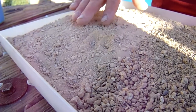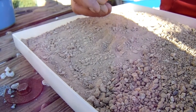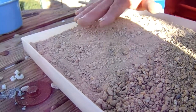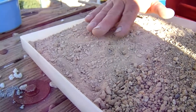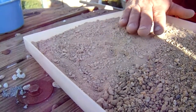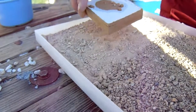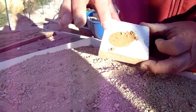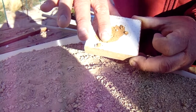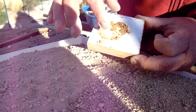This material has had the bulk of the 1/8 inch rock material screened out of it and is basically just a gold dirt. This material is suitable for covering the ground in low water landscapes and potentially some areas where pathways could be installed. I myself would never use this material on a pathway, principally because the 1/8 inch stone fines have been screened out of it and sold as a separate product, and what we have left is really just a gold dirt, and when it gets wet it's very slippery and it's very sticky.